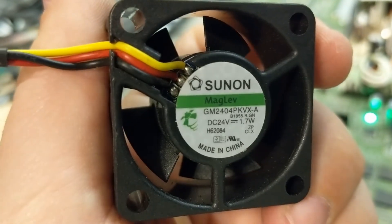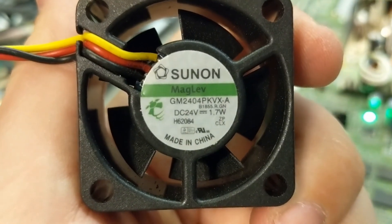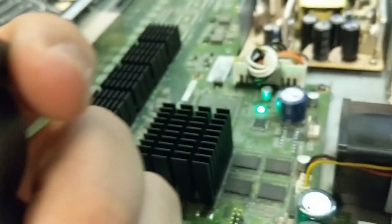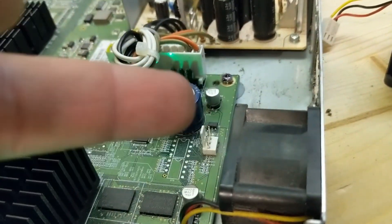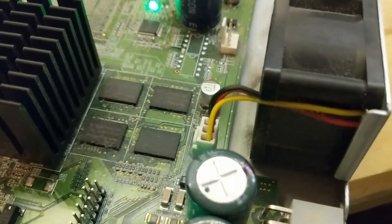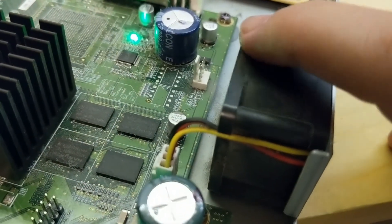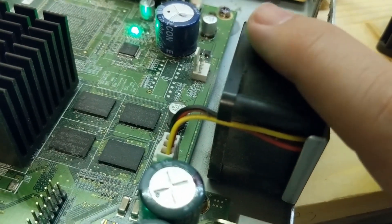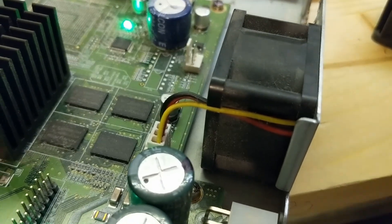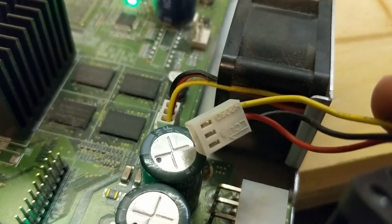This fan was salvaged out of a Cisco machine and it's a 24 volt fan. So the reason is because this 24 volt fan will run at half speed. I was checking the little pins and it's putting out a full 12 volts, and then there's this PWM madness that puts out three volts, so I think it's throttling it down. Basically the fan is only ever going to get a maximum of 12 volts on a 24 volt fan.